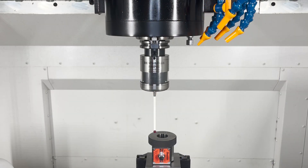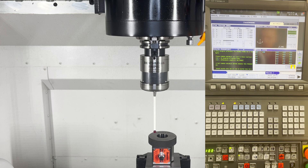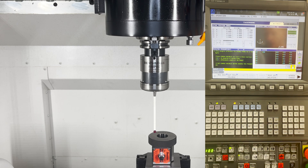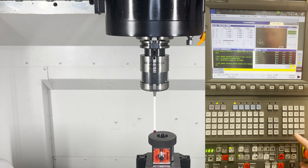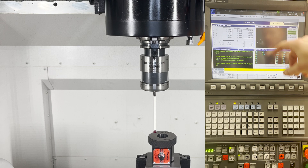Step 3 of the Z-axis calibration is going to be obtaining an approximate probe length. A couple of different ways we can do that — one being using a presetter or a scale to find out the length of the probe. My personal favorite is going to be using the machine itself. The way we do that is by activating the work offset that you found in Step 2, whichever work offset you used. I use number 60, so in this case I'm going to do G15H60, Enter, cycle start. That will make my work offset active, and it should highlight in gold on your work offset page, letting you know that it is the active work offset.